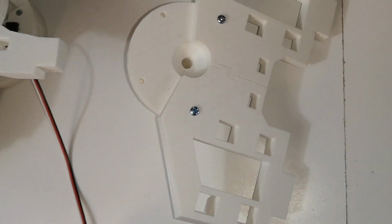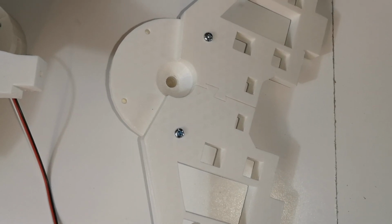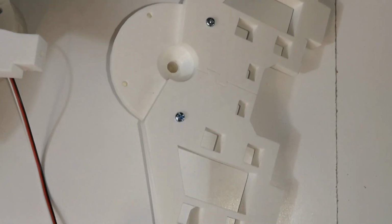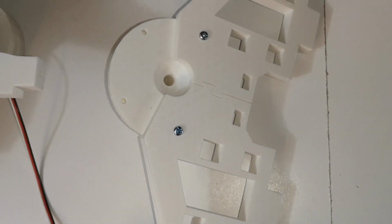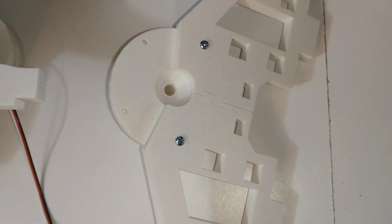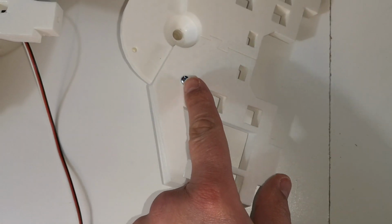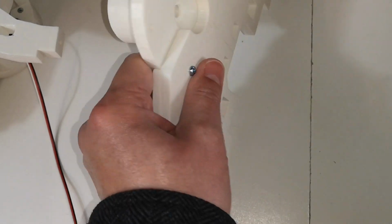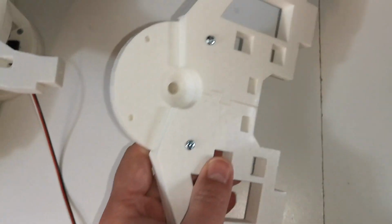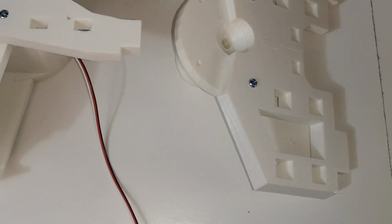You shouldn't really be using a machine screw like this. We should be using a self-tapping screw. I think really the holes in the round parts are a little bigger than what would be ideal. They're just slightly too big for M4, so as I'm tightening the screws up the threads are kind of stripping off. They're okay. I think it'll be good enough, just not really ideal.